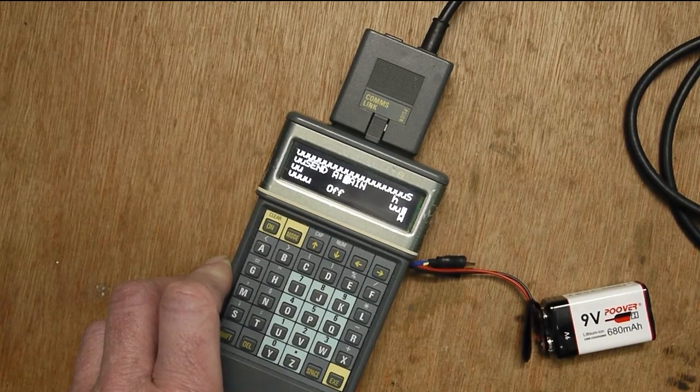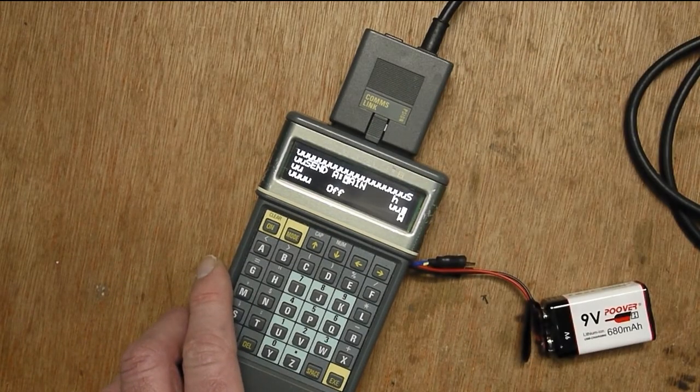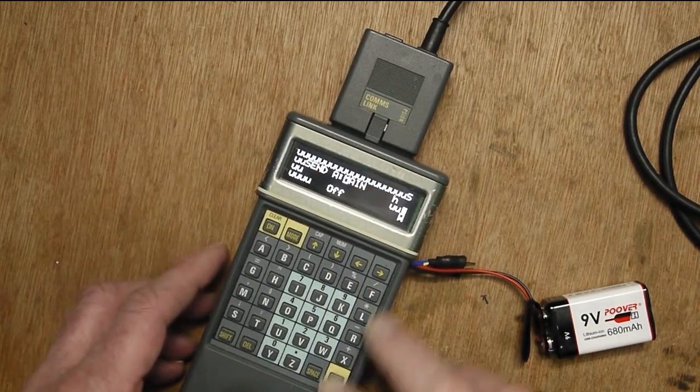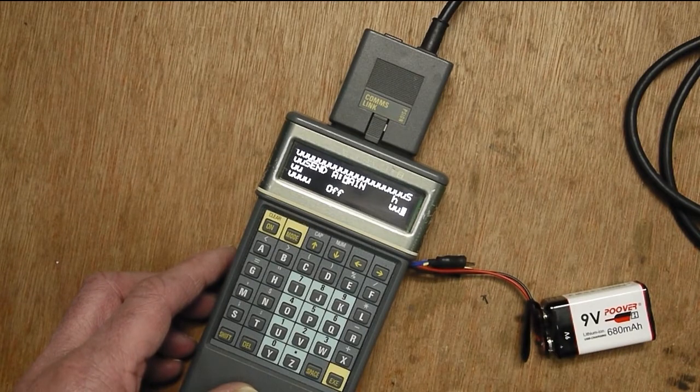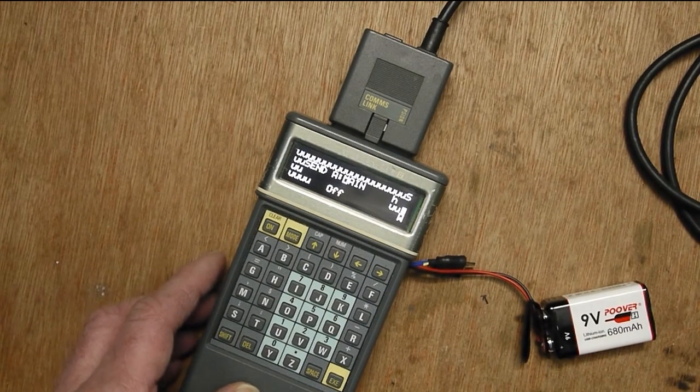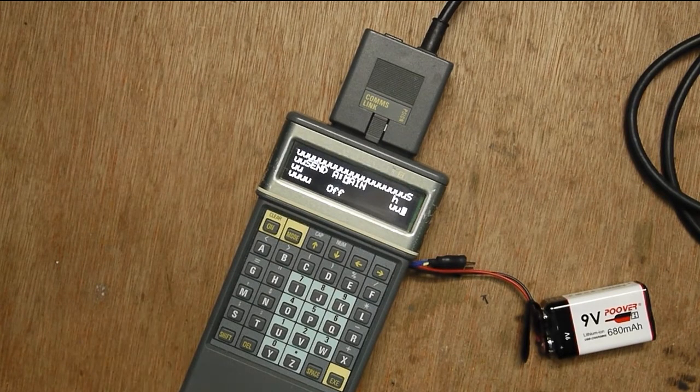So because the real hardware's there, I think a lot of the signals are probably okay, but obviously because this uses, I believe, the serial output capability of slots, which I haven't put in there at the moment, actually sending and receiving data won't work. I think it will be possible to do that though, because those lines are coming directly off the processor. At least I hope I wired it up that way. I'll have to check that.